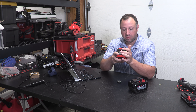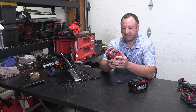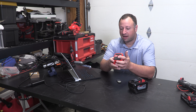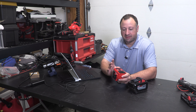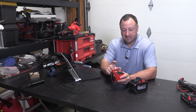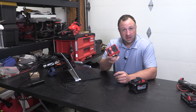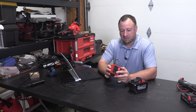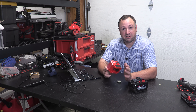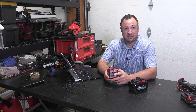Conclusion for this adapter. It actually — and to be honest I hadn't tested this before — even though it's supposedly rated at 45 watts for USB-C output, the fact that we were pushing 55 closer to 60 watts is pretty impressive. I think it's pretty rare for a manufacturer to de-rate their product — though I don't think Milwaukee has ever been guilty of overstating what their tools can do, at least in most of the testing I've seen. So we have stronger than expected performance from the USB-C. The outlet — we were up at 210 watts, so it's handling a peak startup load of 210, maybe even 250. The waveform on this sucks, and this gives you the waveform that you get whenever you buy like a $20 DC-to-AC inverter off Amazon that plugs into your cigarette lighter. I know that Milwaukee was trying to hit a price point with this, but the quality of the waveform on here is just atrocious.